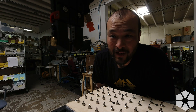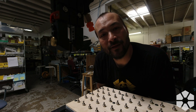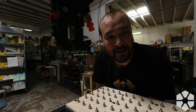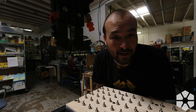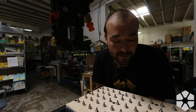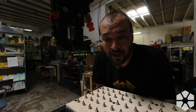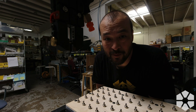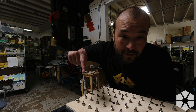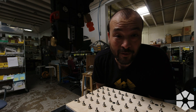We are set up and ready to go. However, despite the fact I've got the machine pinned and the robot is pretty accurate, it is never exactly in the right place on the first part — the laser mark isn't always in the right place. So basically I've got to run a couple and verify that we've got the mark in the correct location, adjust if needed, and then we should be off to the races so the robot can do work while I go do other stuff.